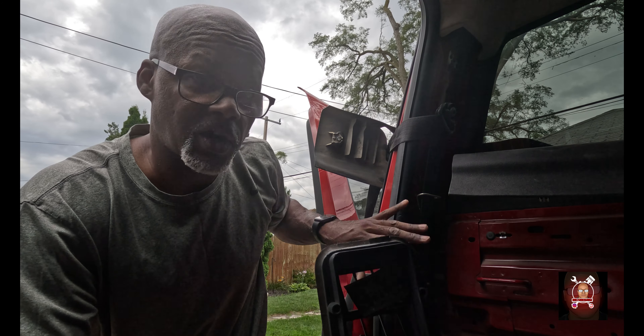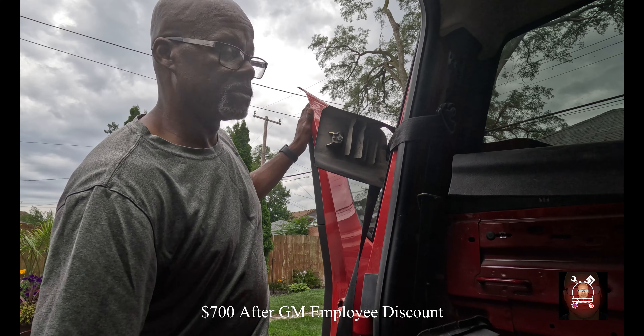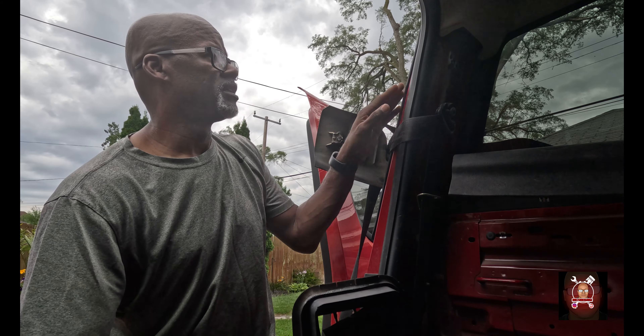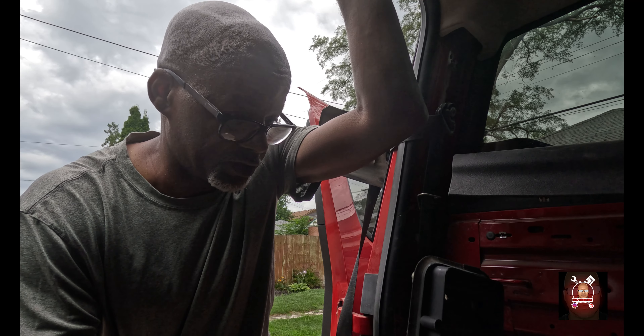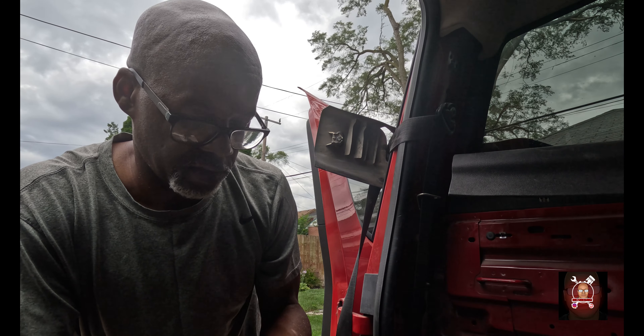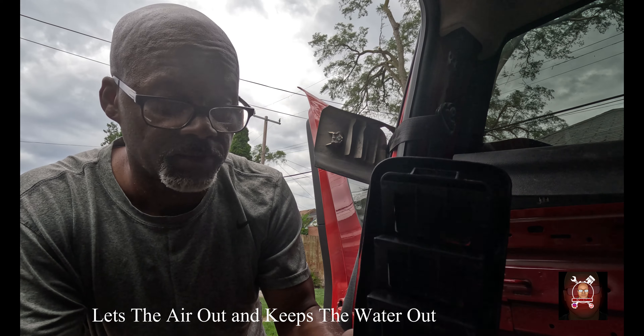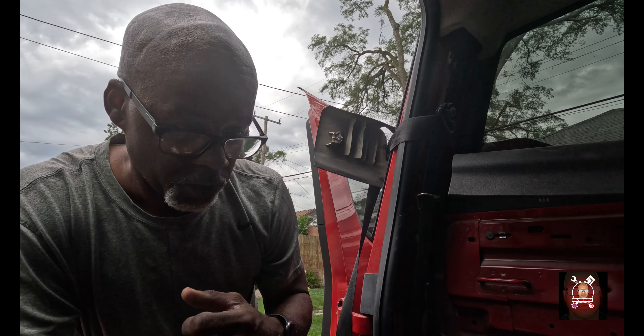This part here — 22 bucks. Those door seals — 700 bucks, and I bought two sets. I feel like I still need to replace the top one too since it's a bit worn. But yeah, this here is the definite cause. Here's the new one — see all those vent flaps in it? The old one doesn't have those anymore. These are supposed to let air out when you close your doors, acting as a pressure reliever. Without them you wouldn't even be able to close the cab door properly.